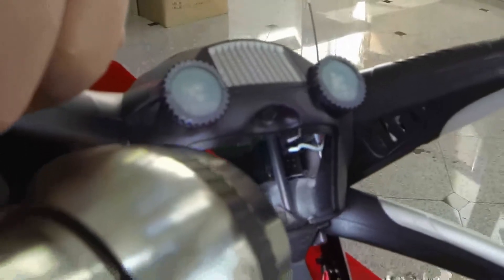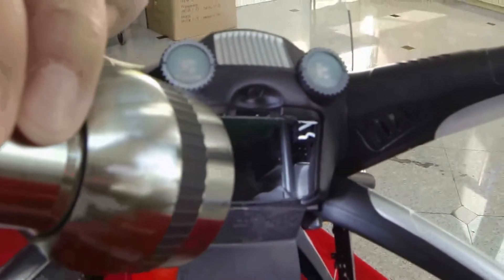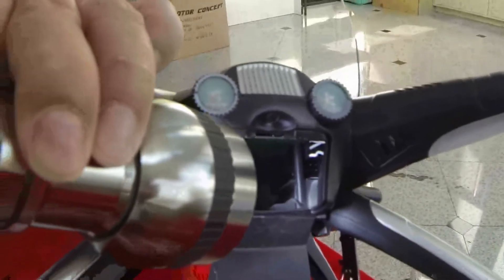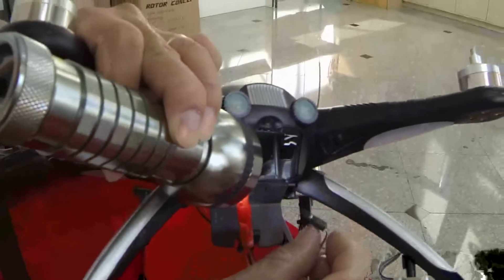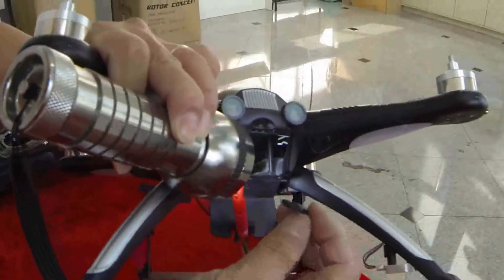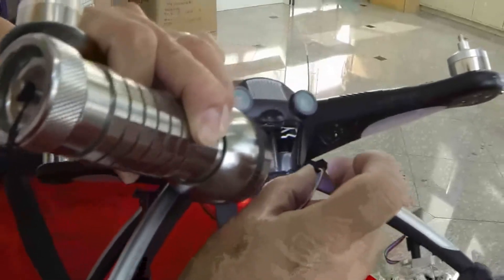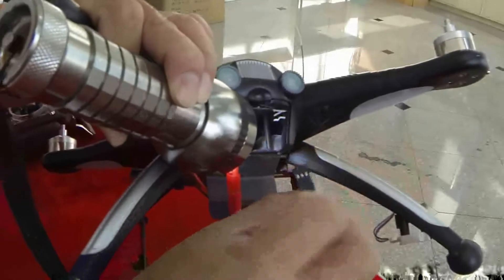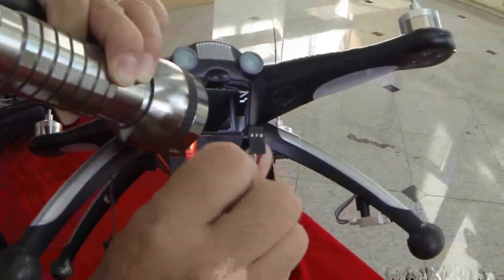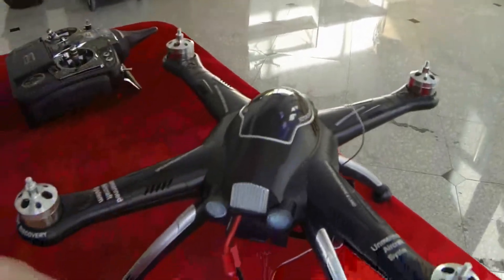Looking at the side of the inside you can see the port is called AUX2, which is the second to the last one. I'm going to plug my connector right into that little socket. Make sure the white portion is aligned with the other white wires on the left side, and the black wire should be on the right side.